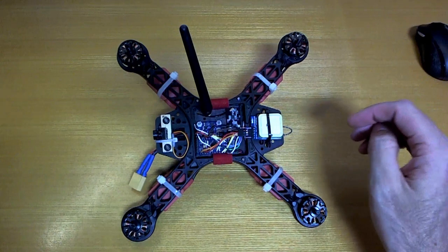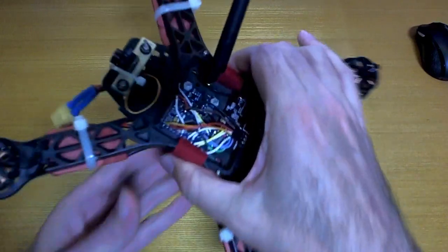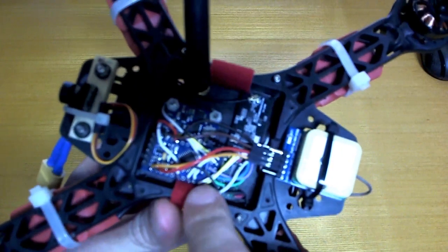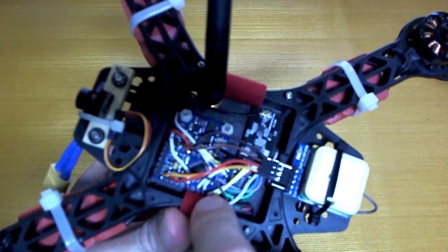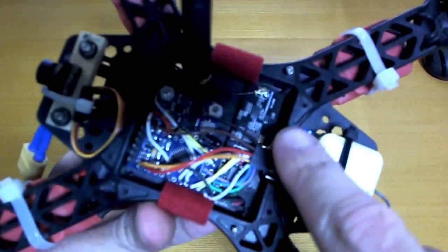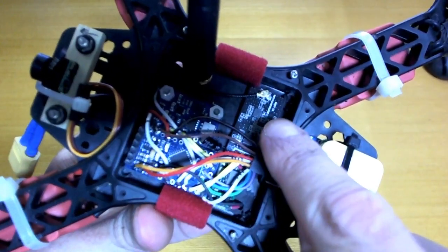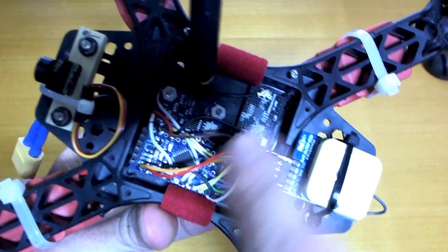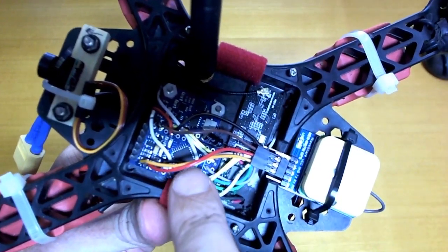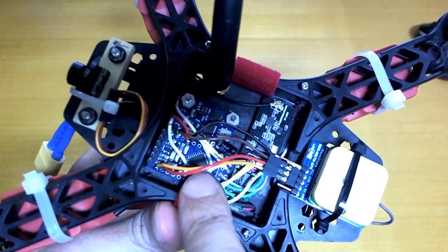I was kind of interested to see how well the 10Hz GPS performs. What we have here is an Arduino Pro Mini using my slightly modified version of MultiWii, which talks directly to the RF24 radio module. The radio is able to send back any binary data that the MultiWii itself knows about, so in this case we're just looking at some numbers to get the GPS location.